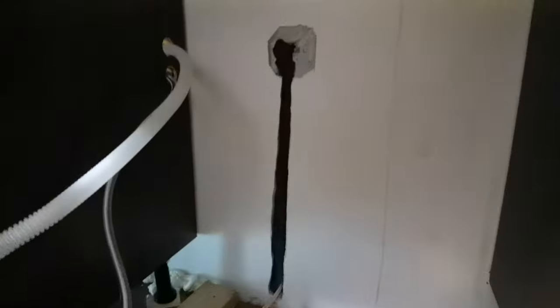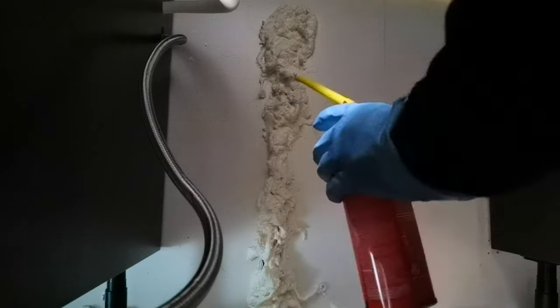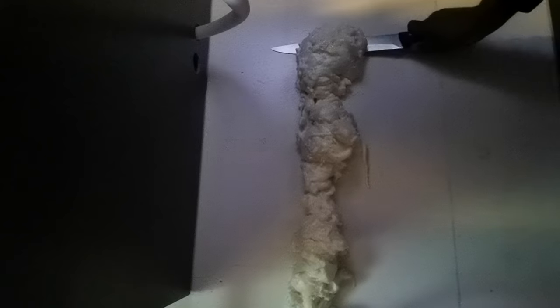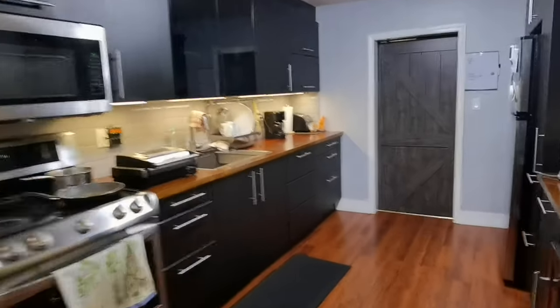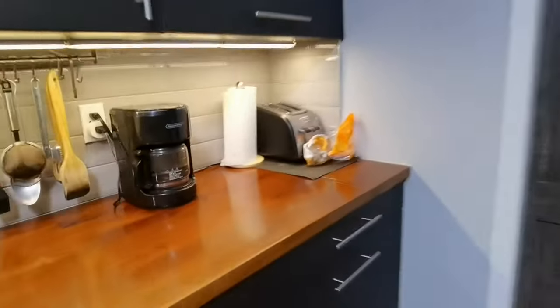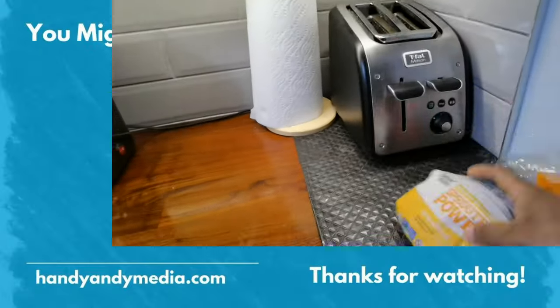The last thing to do is install the steel wool and put it inside that gap, just like I did over here. That ensures the mouse won't chew through it. To fill the hole, I'm using more insulating foam — I went heavy duty since I was going to cut it flat anyway — making sure the entire slot is completely filled so the mouse can't come back. And there it is. I push the dishwasher back, my kitchen is now secure, and I can finally leave my bread beside the toaster without worrying about having a mouse in my house.